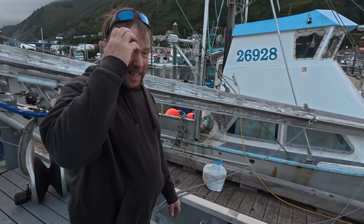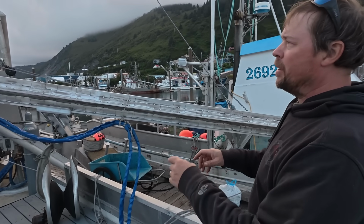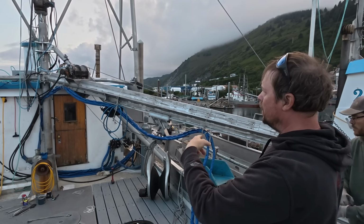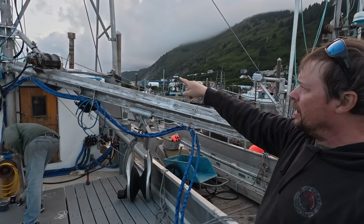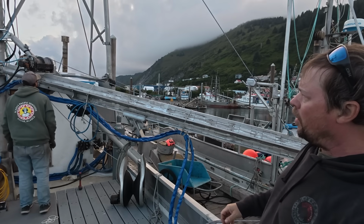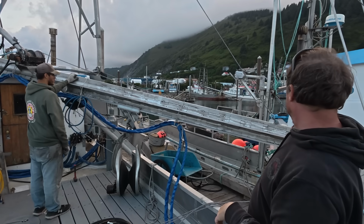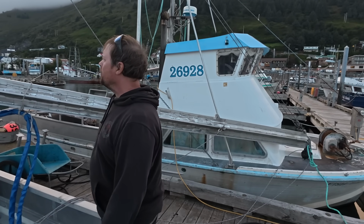All right, just getting this vane winch figured out here. So you have to put extra wraps on one side because as you bring it over one way, it's winding it on, but it's winding it off on the other side of the drum. So we disconnected the cable and then took like 5 extra wraps on there, which is what you want for the minimum amount of wraps on a drum when it's empty spool. And now we'll hook up our port side cable and we'll start to wind that on. It'll let that side go out, and then once the eye reaches the shackle over here, we'll reconnect it, and then we should be starting to make progress, I think.